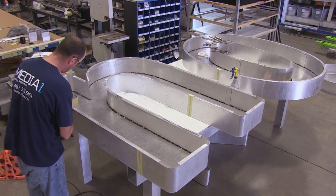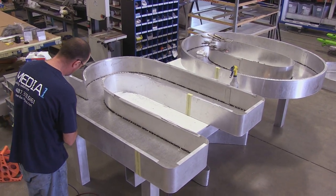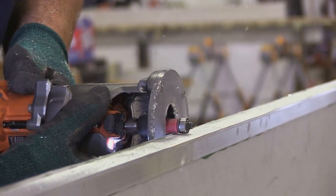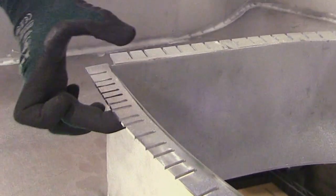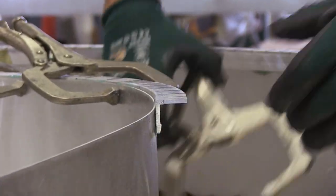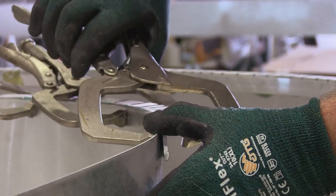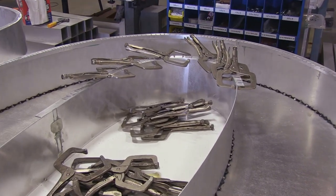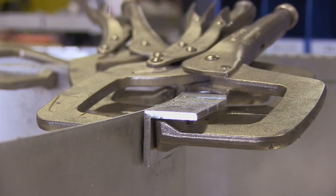After each letter is welded, the next step is to add a lip to the top of the sidewall of the letter, which is notched and has to be hand fabricated to fit the circumference and the stop edges of the letter. It will run the entire top and follow the curves of the letter. Needless to say, it helps to have a ton of clamps.